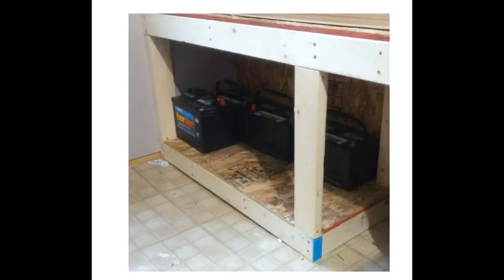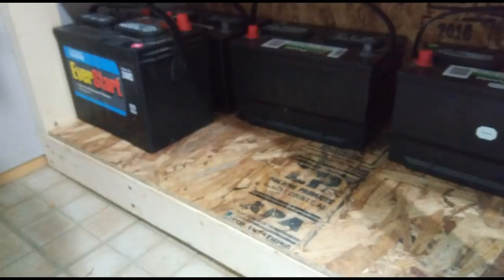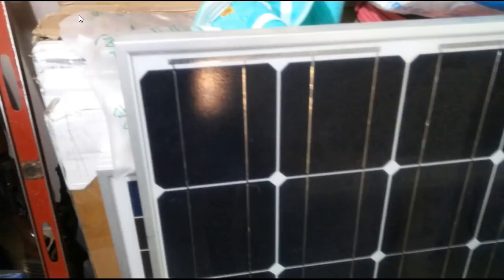I'm going to be running ten solar panels, which is one kilowatt or 1,000 watts, and a 3,000-watt minimum pure sine wave inverter with a 9,000-watt peak. The batteries are up off the floor — notice the shelf. There's two-by-four ribbing going under because batteries are heavy, so this needs to be strong. On the left outer wall is where the two 12-volt DC fans will be exchanging air.